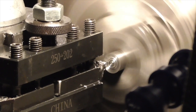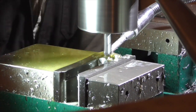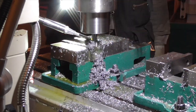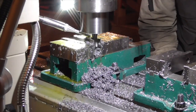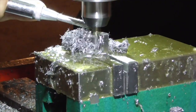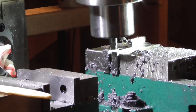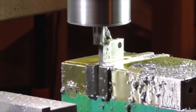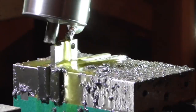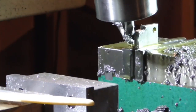Let me clarify that both my lathe and my milling machine are traditional manual machine tools. Contrary to what some commenters assume, I don't have CNC machining capabilities at this point, and that's ultimately by choice. Manual and CNC machines both have their pros and cons. The big advantage of CNC is repeatability — once you have your work holding figured out, your tools set up, and your program written to make a part, then making additional identical parts is as simple as pushing a button. However, it does take more work up front to make the first part on a CNC mill than on a manual mill. So where I'm making mostly one-of-a-kind parts, I can actually save a lot of time by running manual machines instead of CNC.